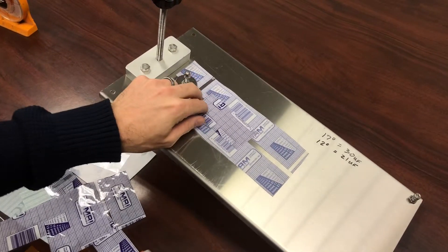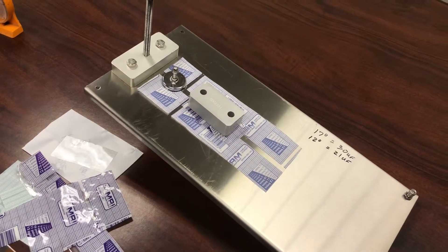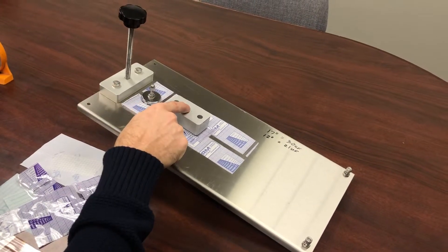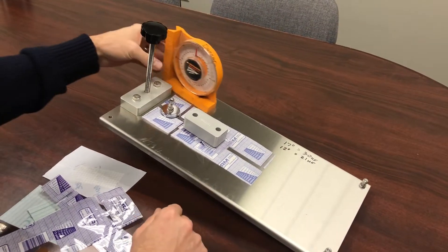Now you'll lay that down with the original inside face to inside. You put your friction sled on it and there you go. Now by raising the angle and noting at what angle the sled goes downward, we can measure the friction force.